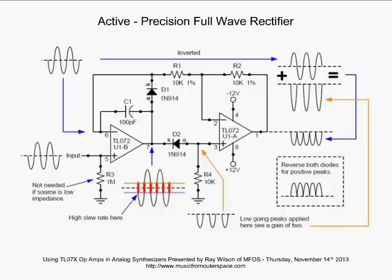But now what's happening? The op-amp is actually adding those two things together. So as the inverted negative going peak starts going high, what do we see? Well, we see a copy of that, only inverted and with a gain of 2 going low. What's going to happen? We're going to get destructive interference to the point that we actually turn the top waveform that's going up upside down, because this times 2 gain on these negative going pulses takes this, does destructive interference, and now, wham, look at that. On the output now, we're looking at a very faithful representation of the input waveform, only fully rectified now.